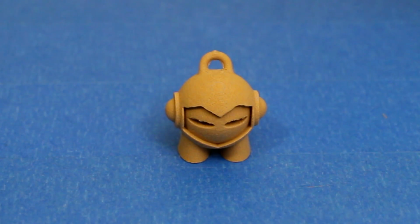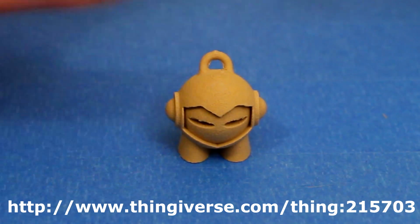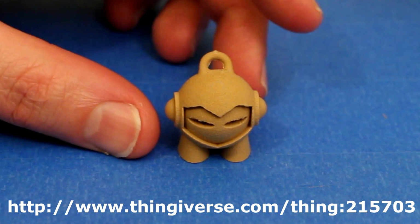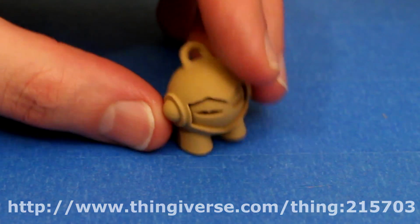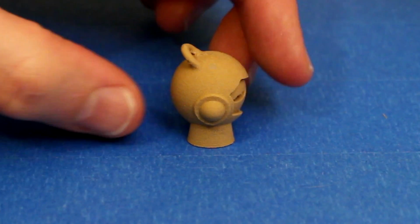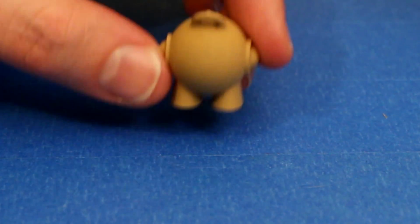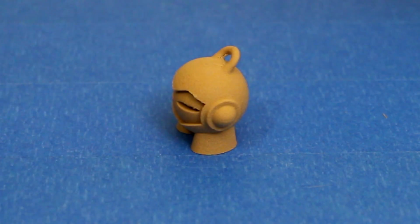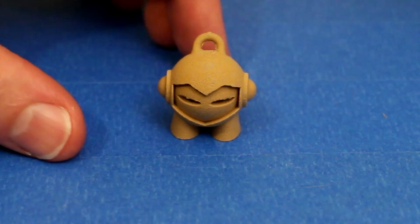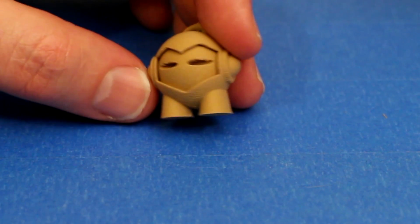And here we have the Marvin Keychain, which is available on Thingiverse. I'll place the link below now. The polywood material printed this without an issue. I printed this at 0.1mm layer height. There are 4 perimeters. It is hollow, so there's no infill. And I printed this quite slowly at 20mm a second because it is quite a small piece. And I was using the cooling fans attached to the hot end with this. And it printed successfully with this polywood material.